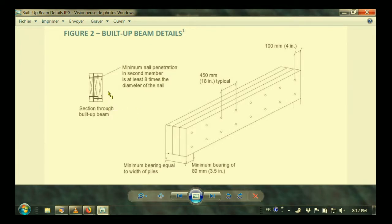What Richard wanted to know was the plywood — he wants to sandwich plywood down the middle of this. The detail is, if you're going to add plywood to a sandwich beam, you put it between two pieces of regular wood. So we would do two plywoods like this and make this whole thing a lot stronger. Putting the plywood on the outside doesn't do nearly as much good. On the inside, it's sandwiched in and really being held. Add some glue and it goes even further to make that work.